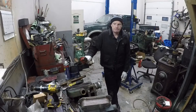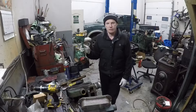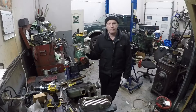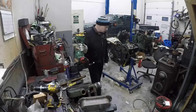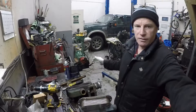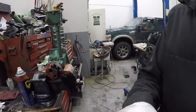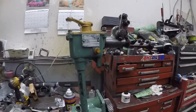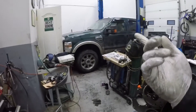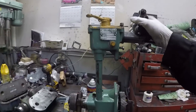Welcome back guys. In this video we're just going to put the governor on and check the backlash. It's not critical but I just like to check and make sure there is a bit of play there. And then we'll put the number two flywheel housing on. I'll cover this governor in another video when I do a tune up on the engine after it's complete. But this is a variable speed governor, and that's different from the limited speed governor that's on my truck engine there, the 453T.